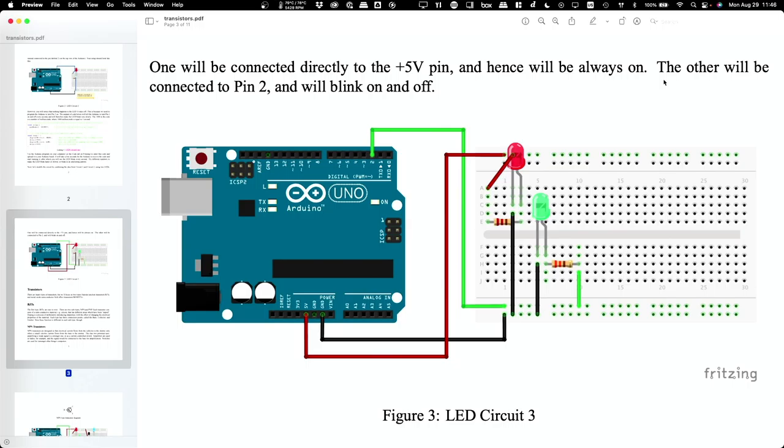Breadboards are sometimes a little stiff. Okay. So, there. I think you had two problems. One, it was in reverse, and two, the black wire that's going back to ground was on the same side, so you actually had a short circuit. Okay, so this one should just stay on, right? And then this one, okay, so we'll flip it this way. Ground here, resistor on the positive side, which is that side of the LED.